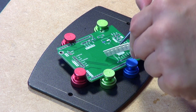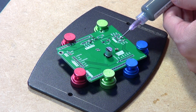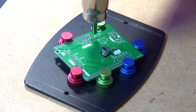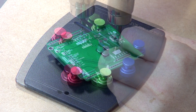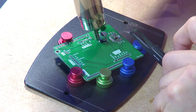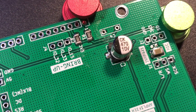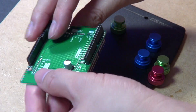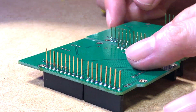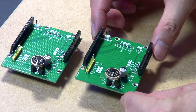This time I have to solder some surface mount components — two resistors and two capacitors. The solder paste I bought from AliExpress is easy to use, but I found it hard to control the amount you want to dispense by hand. I used a heat gun to solder the surface mount components. The hot wind was a little too strong, or maybe the solder paste was too much — when it started to turn liquid, the components floated away and I had to use tweezers to hold them in place. Now everything looks nice; I cleaned it up with alcohol cleaner. After that, I soldered the stackable pin header to the extension hat, plus male pin headers for the display, microphone, and audio amplifier — two sets. Now they are ready to go.